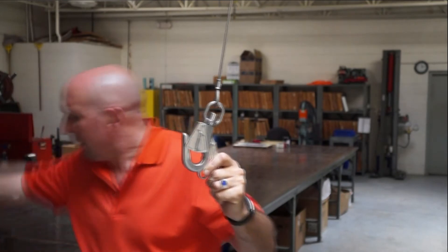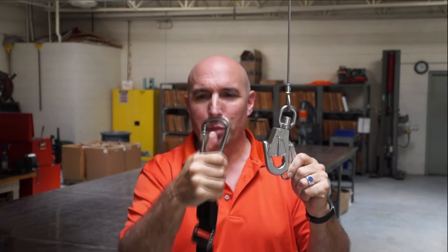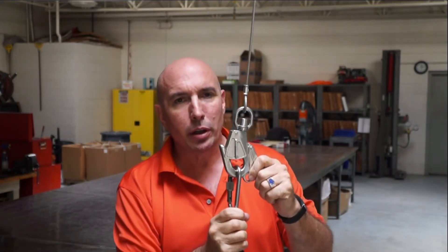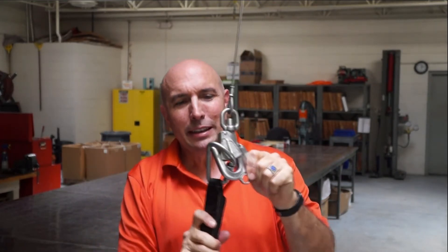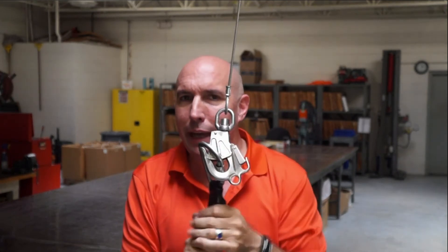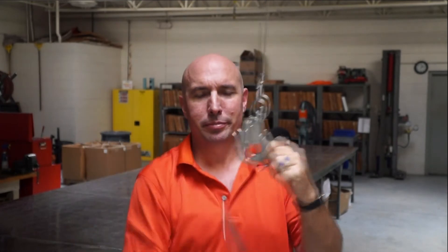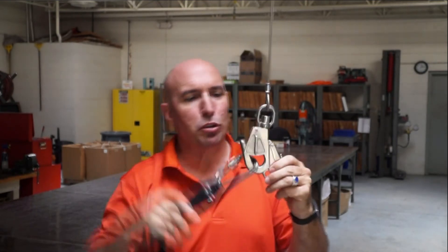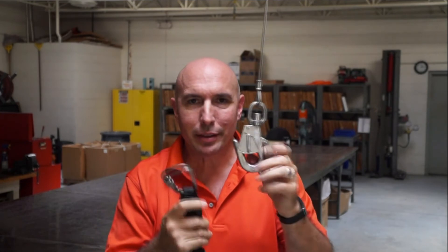Some hooks are more susceptible than others. Again, it's about geometry. This particular brand — the carabiner, this locking carabiner — it goes on the hook. If I roll it this way, it's just at an angle where I'm going to hang from the beak of the hook and from the gate, and that's bad enough. If I roll this way, it just comes right out. Just the way this thing is shaped, it's perfect to get in here and come out. That's ring rollout.